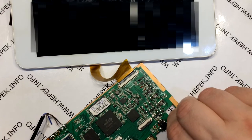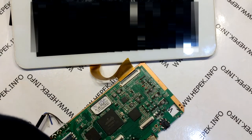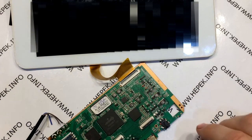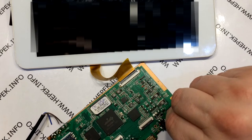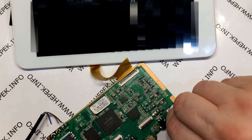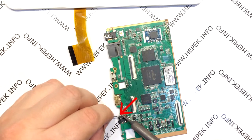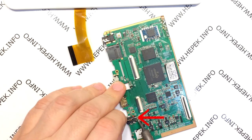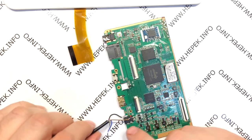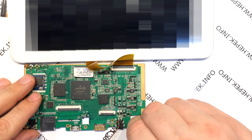When I turned it on, it only flashes briefly because it's not powered enough by the charger I used. Since I don't have the original 2.5mm DC charger, I soldered the positive and negative terminals directly to the 2.5mm charging connector — the negative terminal is the outer one connected to ground, and the positive is the middle pin. Same situation as before. The current conclusion is that the display is a big consumer of power, and I should try without it.